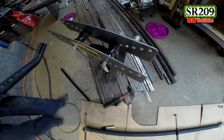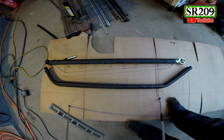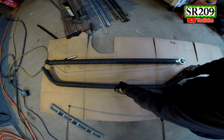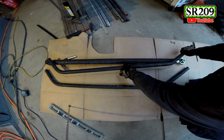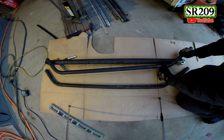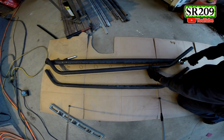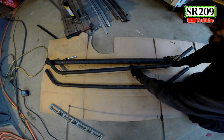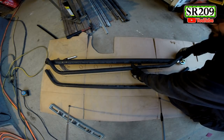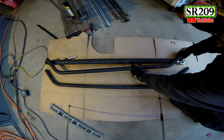They're almost dead on — both of them. Both parts are pretty much almost close to identical. A little bit off on the very tip on that corner, but I'm not going to use that corner so you won't even see it once I'm done trimming. This is pretty much going to set just like that. I'm going to take my cutting wheel and cut straight here and on that side also straight across, then using my plasma or the grinder I'll curve those pieces in a little bit. I don't have a tube notcher so I gotta do this by hand, but that's pretty much it — it's just that easy.